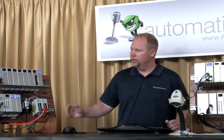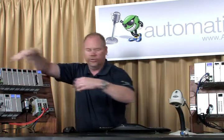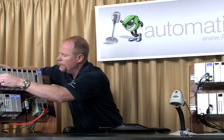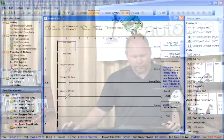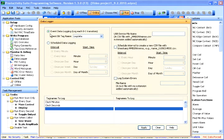Let's take a look at our data logger. Let me transfer our pin drive from our project pin drive, remove that, and put our data logging pin drive in. Under the application tools we'll click on the data logger. The data logger is straightforward. If you want to pull some basic information into a file, you have a couple of options. You can do event data logging, where you specify a tag and when that event triggers in your process you start logging data. I'll choose this log data tag so I can manually trigger it from the data view window.